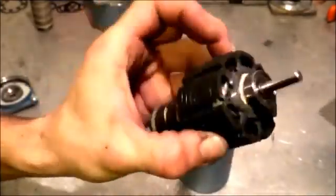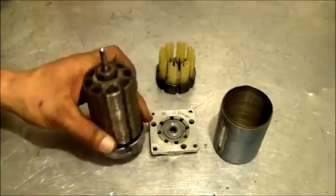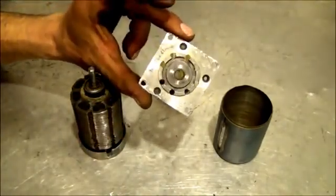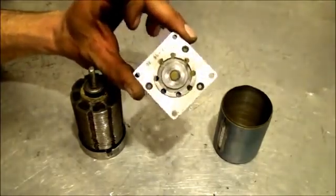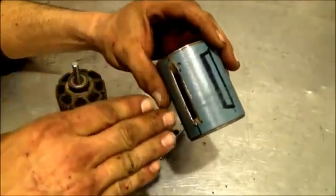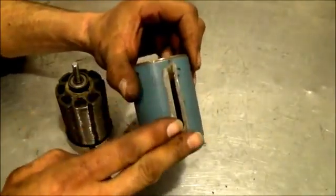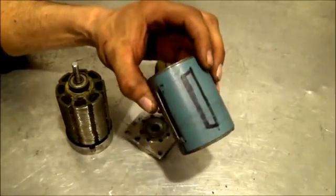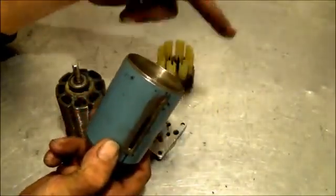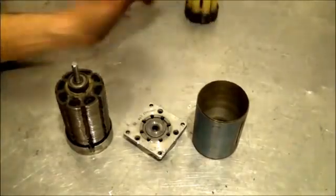I've completed the entire rotor now — you can see all our pieces all the way around, everything's spaced and ready to go. We've got our output holes drilled in the back side of the case and on the front side, all the way around the center drive shaft. We've also got the case ready — I've made a slice all the way down the case with a thin grinder blade, then angled the grinder blade to give one side that's angled with the turbine direction and the other side a blunt edge. This is always going to spin in one direction; these are just test turbines. Now we need to build an outer case to get air or water flowing in a vortex direction, spinning it into the case to deliver that force into our Tesla turbine.